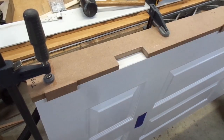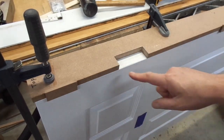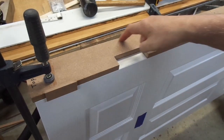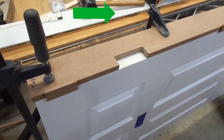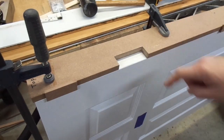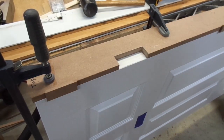You don't need to build a jig like this to hang a door. You could certainly measure very carefully with chisels and freehand routing. You could also build a jig to do a single hinge and then just very carefully measure. I have a video where I did an oak doorway quite a while ago, and that's what we did — the doors already had the mortises in them, and we just had to build a door frame lining up those six hinges. The mortises in the frame had to match those in the doors, and I had a single-use template to rout the hinge mortises. We just very carefully lined it up six times and did it that way.